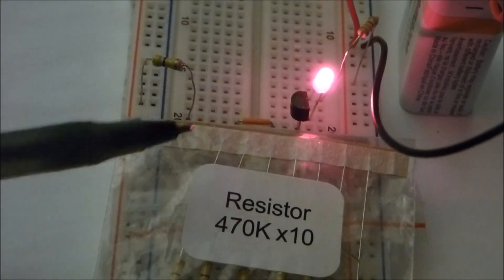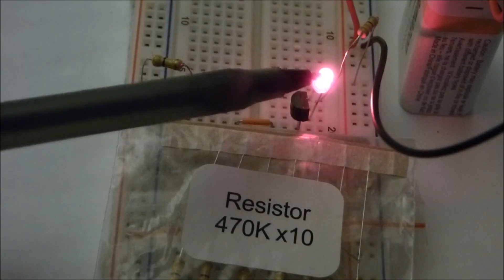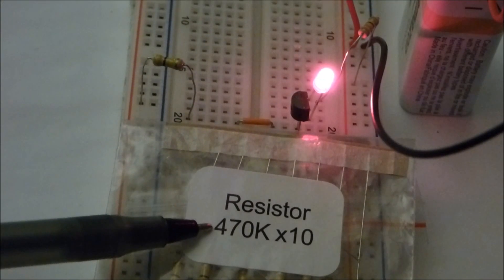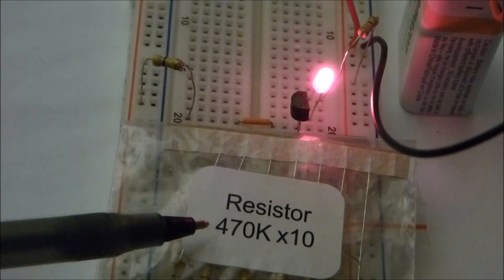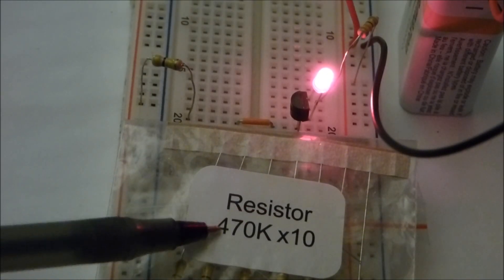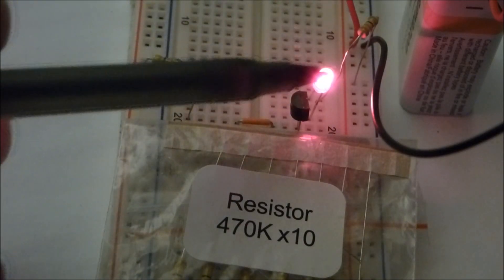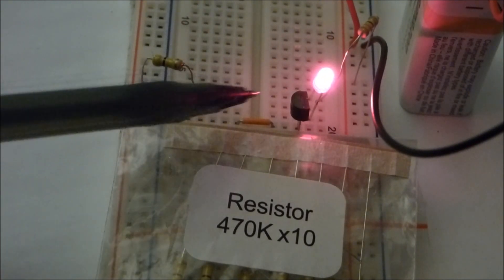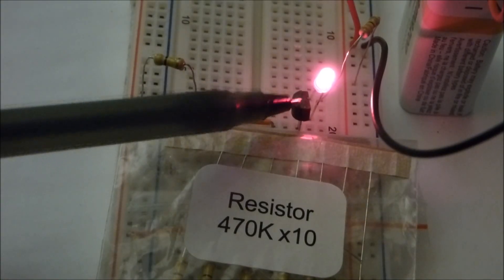So I put in a more common LED. This is a little LED, and they light up a little bit easier than most LEDs. I wanted the other LED to show that this resistor, which connects the positive power to the base, is a 470 kilo-ohm resistor. Normally, that's too much resistance, even with the 9-volt, to light an LED. It kind of lights up these little ones, but they're really dim. All this is doing is sending the positive charge to the transistor to turn it on.